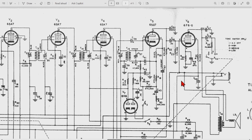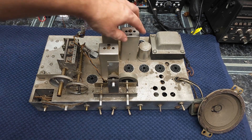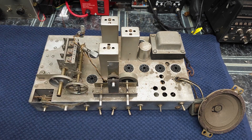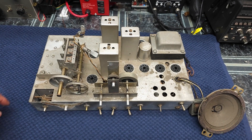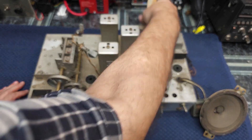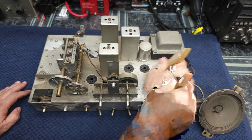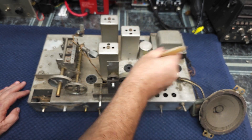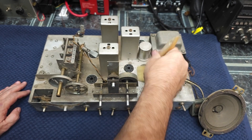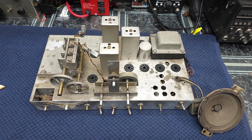Let's take a peek at the top of the chassis. This is the filter cap that, when we flip it over, we're going to do our line cord modifications and then move on to this filter cap. This is the one we're going to take off. I'm just going to get all the dust and dirt away — you can see the dust comes off fairly easy, leaving hopefully a good finish for when I hit it with my chemical cleaner.